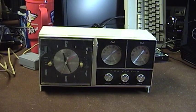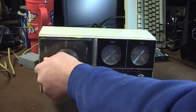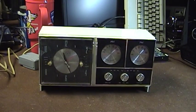What's more, this problem is very easy to fix. The failure here is bad filter capacitors inside the unit. When the filter capacitors are working properly, they filter out the 60 cycle hum from the AC power line. When they are no longer working properly, the result is a deafening hum — very loud and totally unaffected by the volume control, because it's getting into the circuitry before the preamplifier can do anything about it. Powering up a piece of equipment like this is seldom a good idea, but when someone's already done it, things probably can't get a whole lot worse.